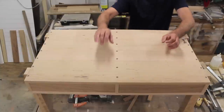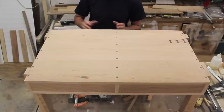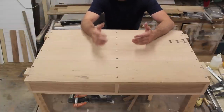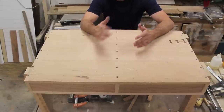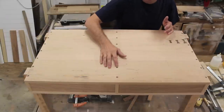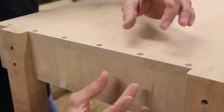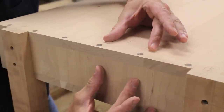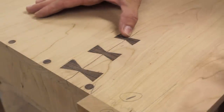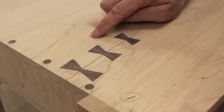This coffee table is based on the design of a writing desk I made a few years ago. That writing desk was put together using dovetail joints on the ends and a sliding dovetail on the center. I didn't have the time to build this with dovetails, and the client — it's being built on a budget, both in time and in price. So I screwed the cabinet together and filled the screw holes with plugs. When you build a piece of furniture in solid wood, it's important that the grain runs in the same direction so the wood can expand and contract together. I used a few Dutchman joints to repair a crack in the top of the coffee table — not only does that repair the crack, but it also adds a nice design element. If you'd like to know more about Dutchman joints, just click on the link right here.